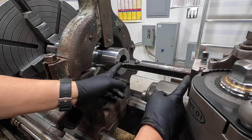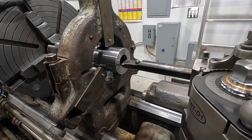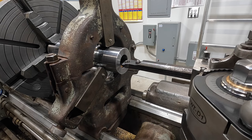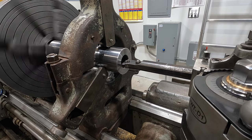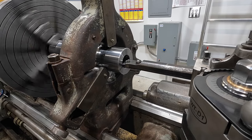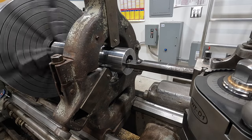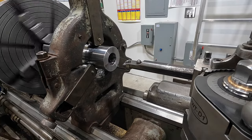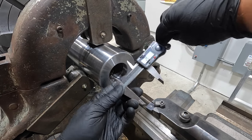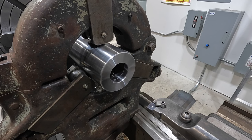We've got our first bar set up - I've got it stuck out nine inches. We're going to go just over halfway on our clearance bore, just making it something over two inches for the two inch pin to slide through. It doesn't have to be on size. Then I'll pull this out and use a shorter boring bar for the counter bore for the bushing. I've got it touched off - I'm using a pretty sharp insert to try to reduce chatter. I'm not really concerned about the finish, I just want a clearance hole. We're right at two inches, about two to three thousandths over. I'm going to take another 50 thousandths on the dial.